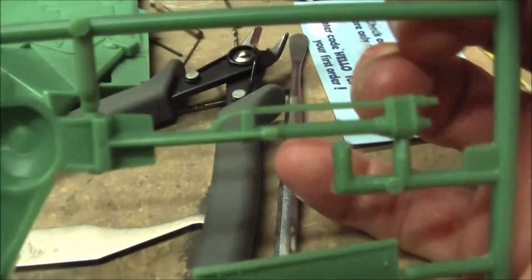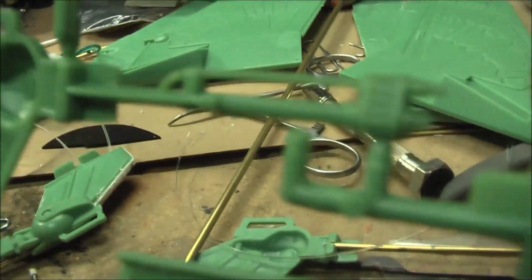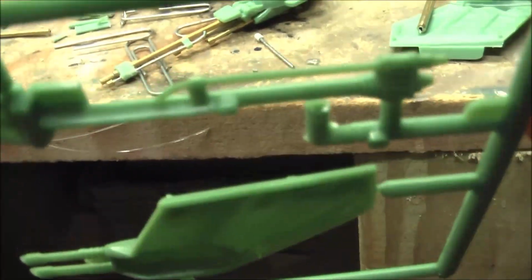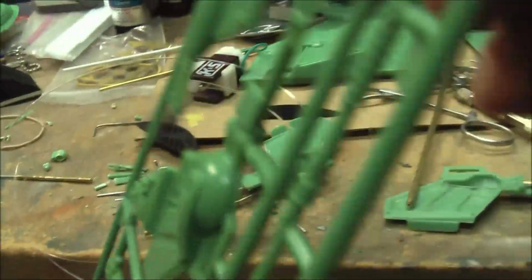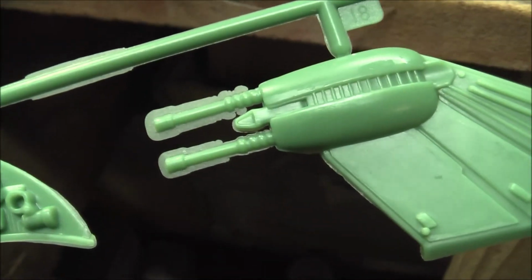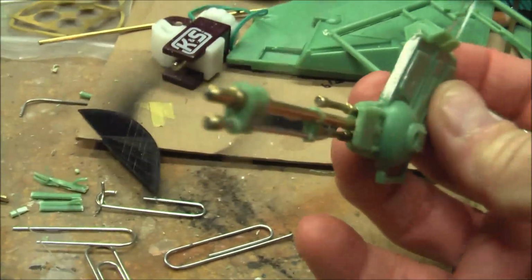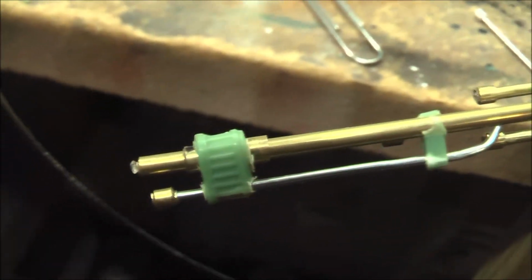These are the two parts, and as you can see, the tubing is kind of lame. I tried drilling through the center to see if I could thread a fiber optic, and of course I melted it even at low speeds. So the only option really is to reconstruct it with brass tubing or steel tubing or some such thing. The other part that goes with it is this one right here, and that's also reconstructed. So I already finished the starboard one, at least gluing it together and reconstructing it. As you can see, I salvaged that part and that part because they're needed for holding it together.